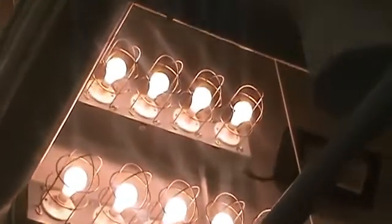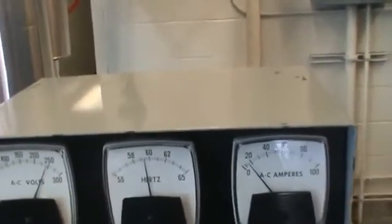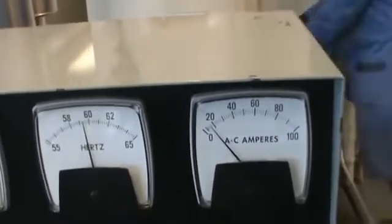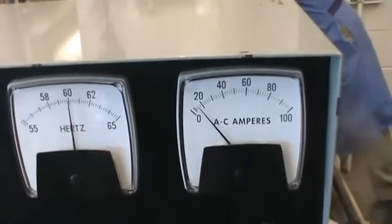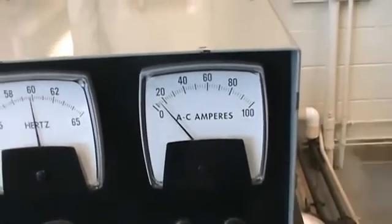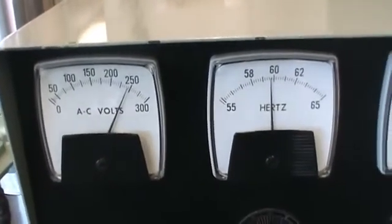Each heating element is 500 watts. One 500, another 500 — total is 2000 watts. After putting the load on, I have to recheck my frequency. You can see it dropped down to 59.5 hertz already. Anywhere between 59.5 and 60.5 is okay, but I'll adjust it up to 60. Now it's at 60 hertz. We're ready to put some more load on. That is how you start the turbine and bring it online.